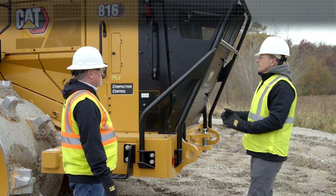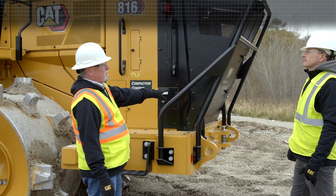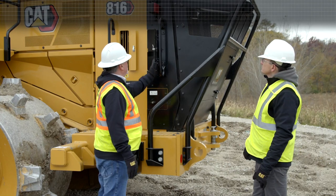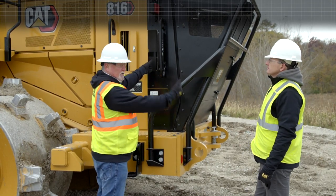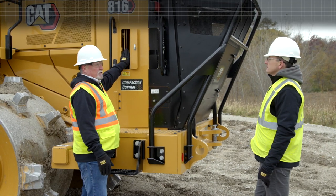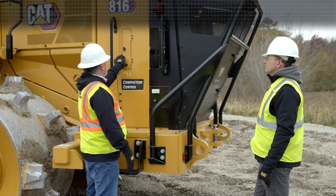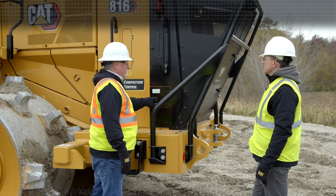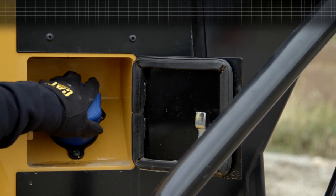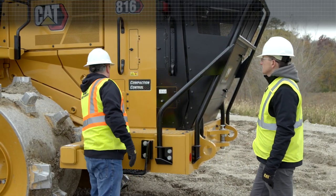Let's talk about these doors and how we can use them to inspect. We just showed you how to inspect from the side, but to get a quick look in front of the fan, we have this inspection door and another one with it, in case you don't want to go around back. So you can see behind the cooler cores from the rear, and in front where the fan is. We put this guard here to prevent people from sticking their hand in — there's a safety factor, but it still allows full pass inspection. Coming down here, we have our DEF filler tube, sealed to keep the environment out. A sealed cap, not vented — the remote vent is inside the cooling package and protected. All of that is for keeping it clean and keeping contamination out.